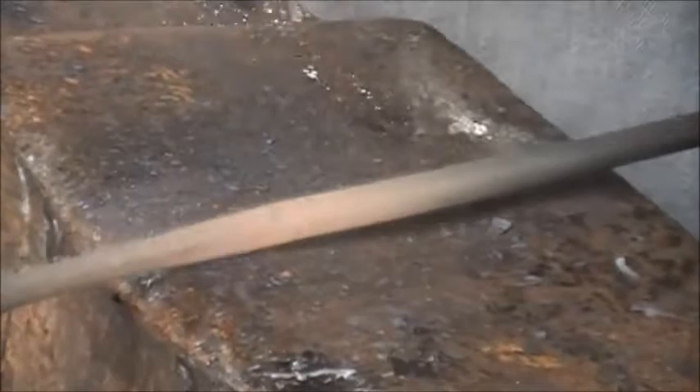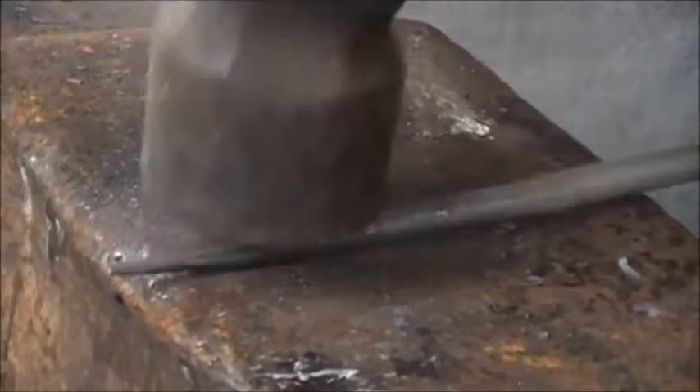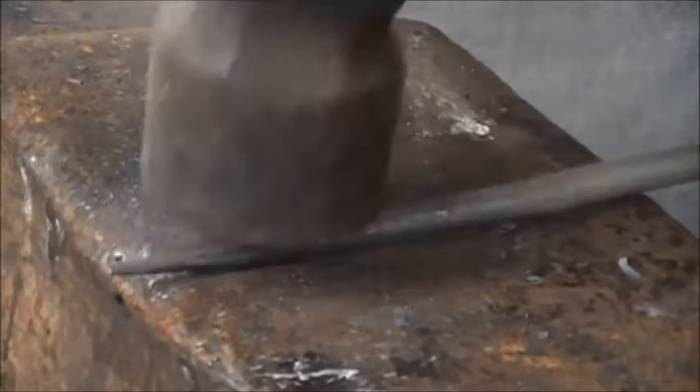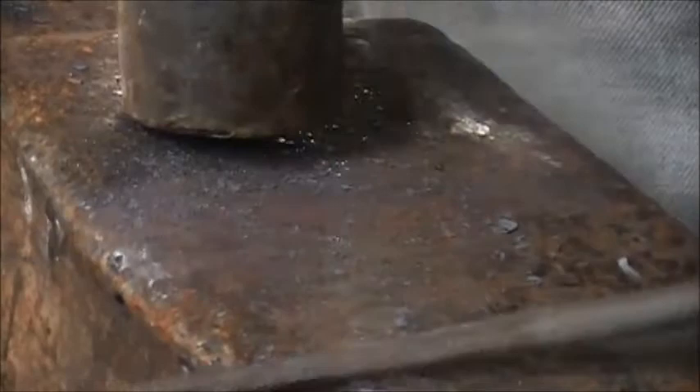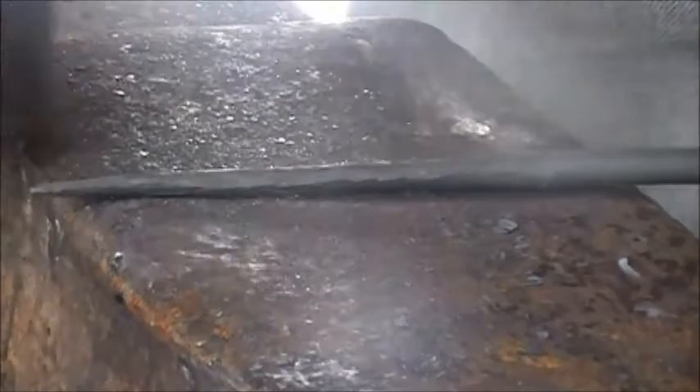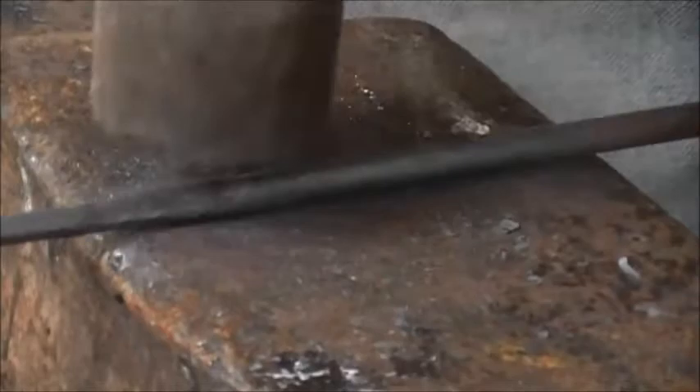Get all those corners off. Now we've got this pretty good so far. We can keep going a little bit more with a cooler heat since we're not really moving the metal — mostly just planishing at this point, taking out any hammer marks. You can keep going with this for a little bit. Try to focus on that transition where it went from the round to the square — that's usually a pretty difficult spot to get to round up cleanly.